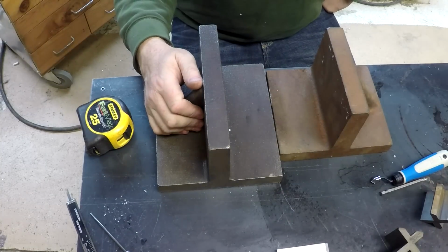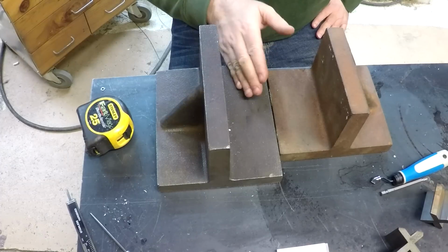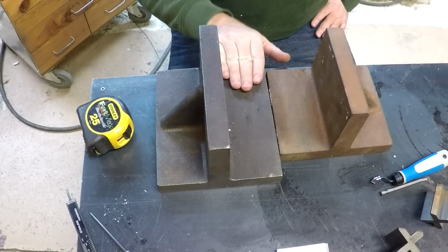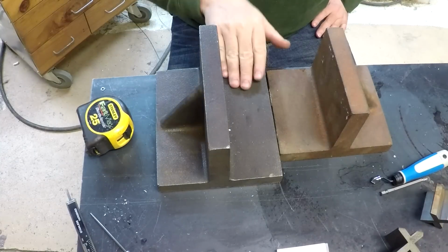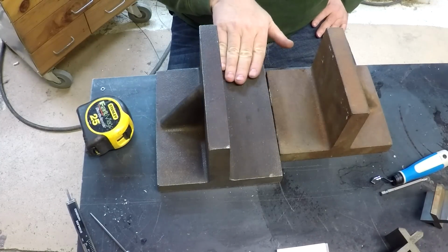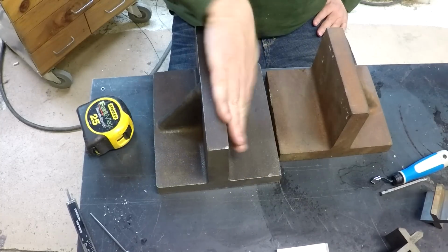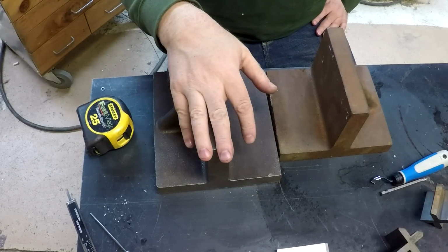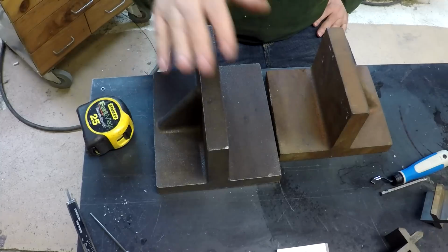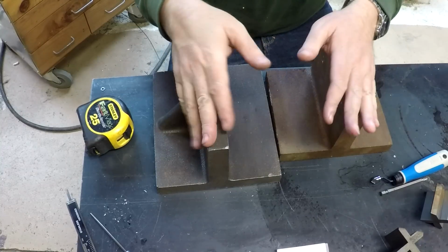So we're going to be doing some machining on these real soon. Any comments or questions on whether or not to keep this T-shaped web, let me know. It certainly will complicate machining a little bit, because I'll have to machine this surface. I'll have to cut a relief groove in here, and then I'll have to machine this surface. And then same with the tops and the sides and the bottom. So it does complicate the machining process a bit, but possibly could be useful.